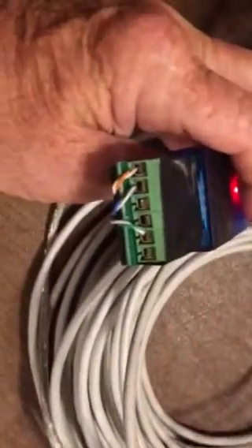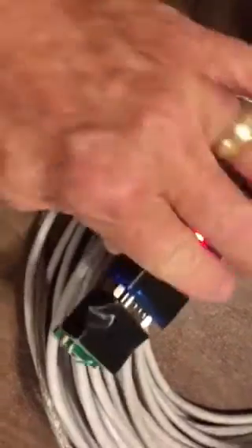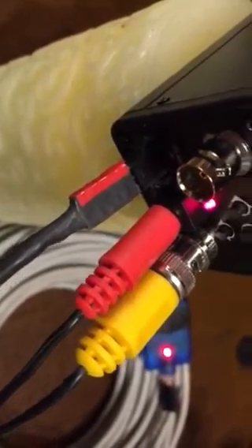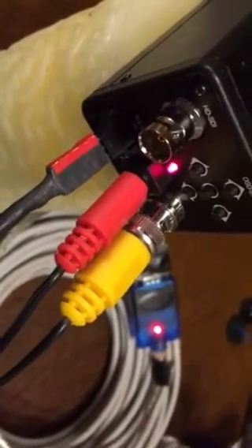The other connection is the control cable that I made out of some old phone line. I have it tied onto the little adapter. You can see where I have the wires hooked. On the other end I made a little plug. The left plug is positive, because I didn't have one of those little cables that I think came with your camera. I have the power and the composite video out. I'm not using the SDI.